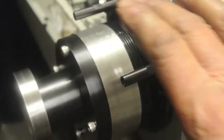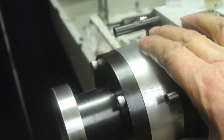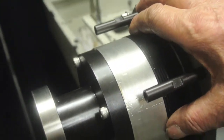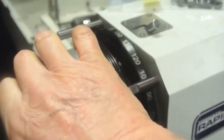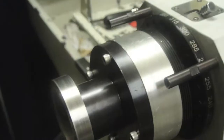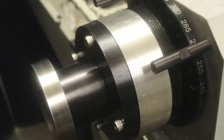What I was making in aluminium was this spacer. This is part of the collet closer and it's meant to fit on a spigot — you're meant to set it up nice and true. I actually machined a register on the pulley so it fits, and it's a lovely good fit — within half a thousandth of an inch of concentricity at most — so I'm happy with that. Next I'll check how much I need to cut off.